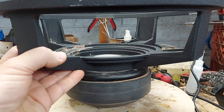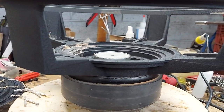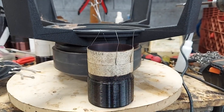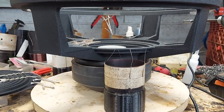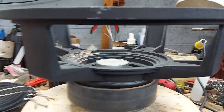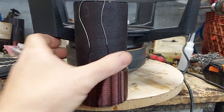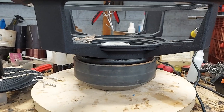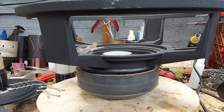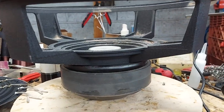Typically for venting you only want to go about 10 millimeters, though you can go taller — it doesn't make a difference. The only problem you'll run into is that you then need a taller former. When I was buying from PE, I would order all my formers as tall as I could get them because it only costs about 10 or 15 cents more, but it gives me flexibility. Later I can put spacers in between and do whatever I want, then just cut down the excess. Always think ahead — think about the next person who has to service the thing. This is technically electromechanical work, so technically I'm an EM tech.